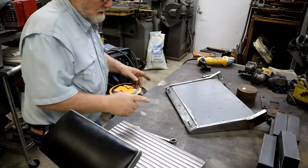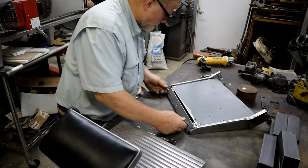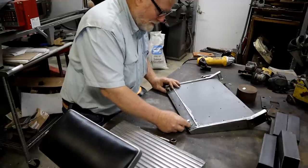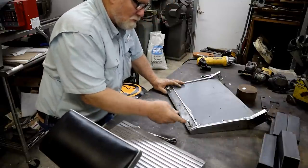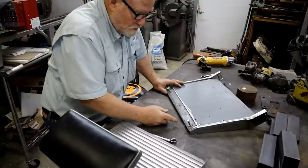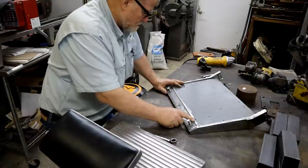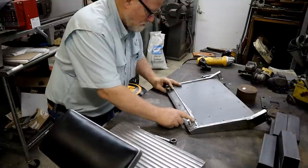All right. Put the bolts back in these two threaded holes so I can line them up with that. I don't think that's very precision back there. What strikes me is these holes are threaded, so they're more precision than the wallered out ones behind it. So what I'm going to do is line all this up and tack it in place and see what we can do.